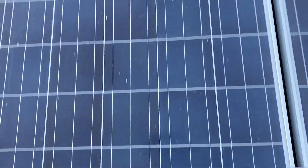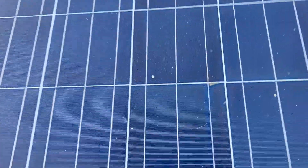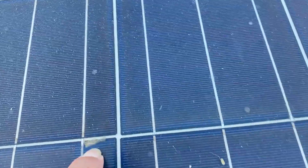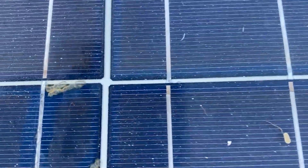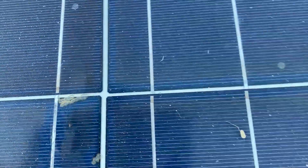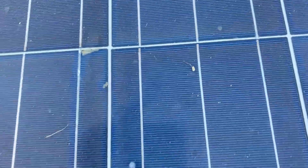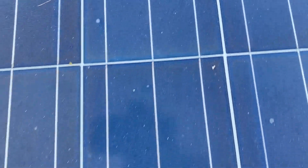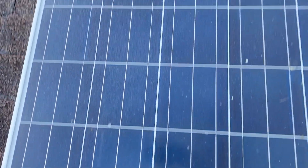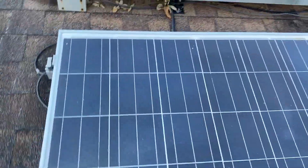This solar panel is no bueno, no good. No broken glass, but we've got another mark right here — that's another snail trail. The solar panel is shorting out right there. There's another little piece right there — this one is also shorting out. The rest just looks like dirt, but that also is no bueno, no good on that one.